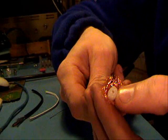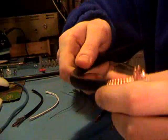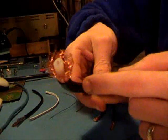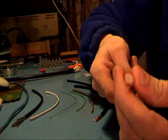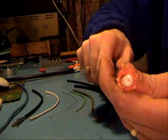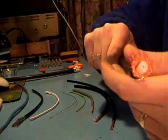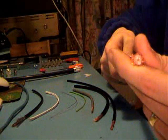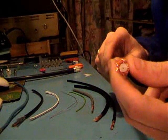Any problem with having a single inner core is, if you go past the bend radius you can actually break it, and you'll have to replace the whole cable unless you can find out where it is. Without cutting through or using special equipment, which would be quite expensive, you won't be able to find out where the break is. So there's the RG213 — it's better for VHF and up, VHF, UHF, SHF, as losses are a bit more significant in these frequency spectrums, whereas HF isn't too bad. But obviously the better the feeder you've got to your antenna, the better.